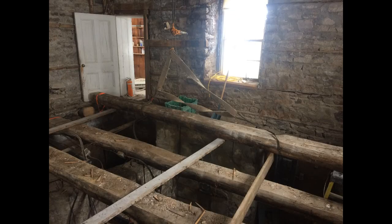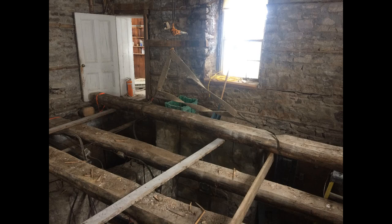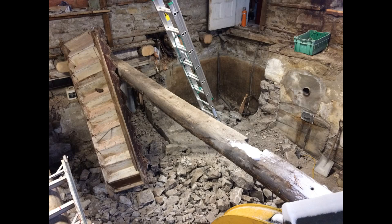After we got started we were eager to keep going, so we missed a few photos along the way. This is now the remainder of the first floor. 180 years ago, logs were milled flat and then used as floor joists. After supporting the floor for that time, they had a big bow in the middle and started to dry rot. I used a chain hoist from the second floor to move these beams to the center of the house and pulled them out through the front door with my truck.